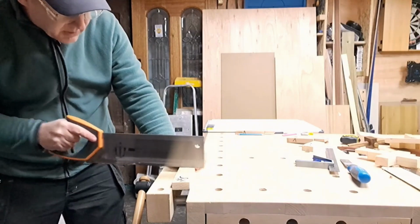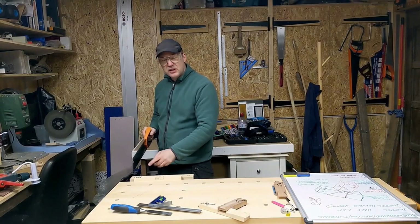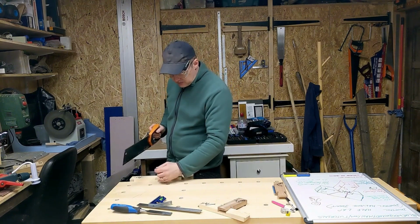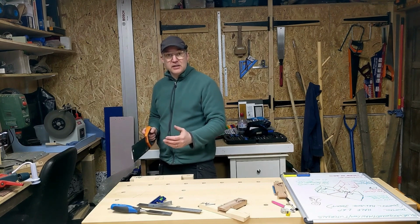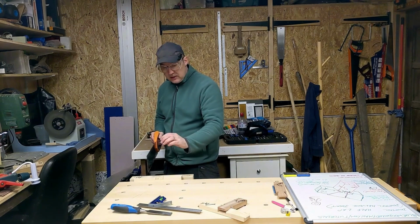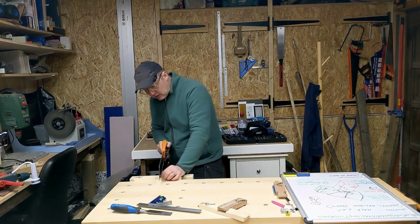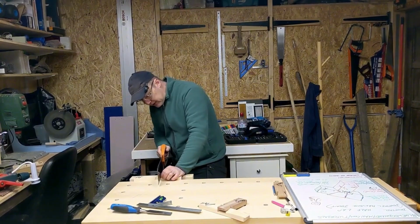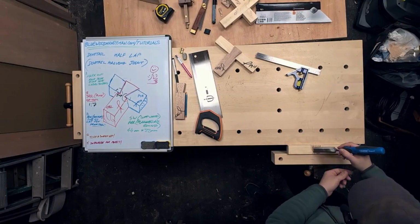So this is a fair bit of cutting. I've done this myself before. I thought if I put 3 cuts in here and I knock it out with a chisel, that'll be okay. But more often than not, what happens is it breaks out the timber on the other side, and then you're starting over again, and that just takes even longer. So I find stick with it. Lots of relief cuts, less likely for any damage, and it tends to be generally quicker and more accurate. It's also less wasteful because you don't have to start over again or run that risk. The other thing is I just find it so rewarding and satisfying to crunch these out.